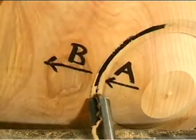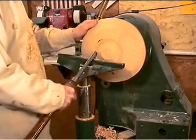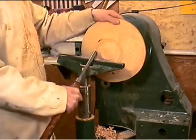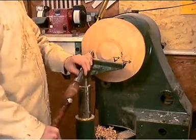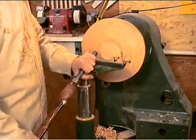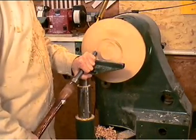The force of this cut thrusts the tool back against its bevel. The bevel rests on this part of the wood here, behind the cut. When a gap in the surface comes round, the tool is thrust into it by the force of the cut, as well as by the hand that is pushing the tool into the cut. This hand, on the steel, resists that drop force.